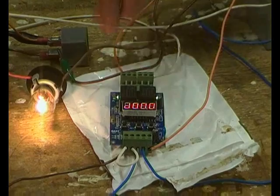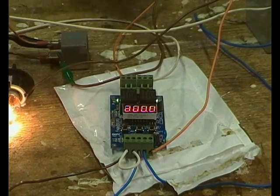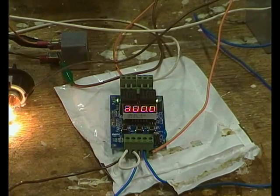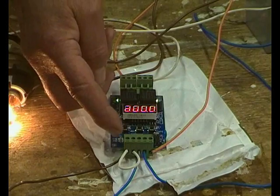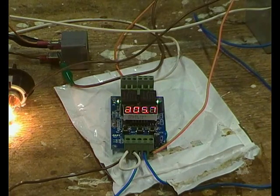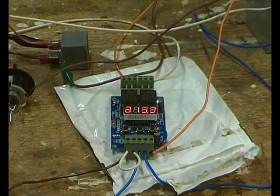I've got a bulb here — I'll move it to the side so we can see. You can see just here that the relay contacts are closed, so effectively it represents the solar panels charging through. Both LEDs are on. Now we're going to put some voltage into V1 and V2 — let's turn the voltage up. What we're looking for is this one to switch off. There we go — that set of panels is switched off but this set is still on.